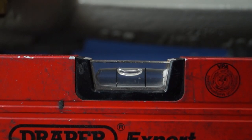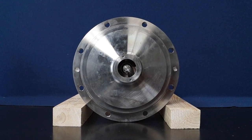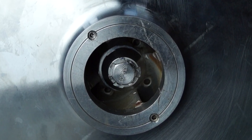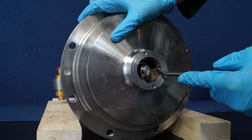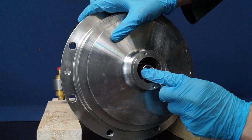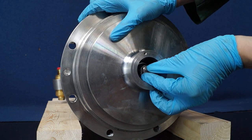Place on a level surface making sure level is maintained to prevent oil spillage. Locate the lock washer which secures the impeller to the shaft. Carefully unset the lock washer retaining tab. Now loosen in an anti-clockwise direction the hex set and fully remove.